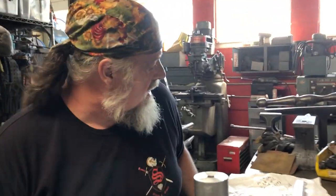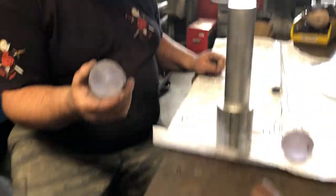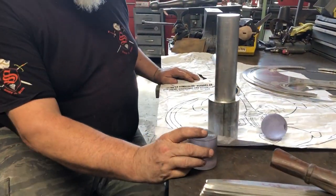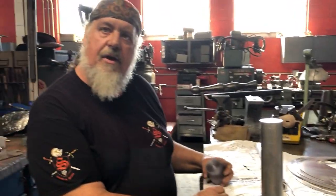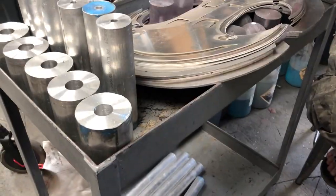So that cap — I've got it drilled with a number seven hole — I'll shape it up on the lathe, polish it all up, hit it with the green translucent paint, and thread it with a 3/8-16 all-thread that's going to run through everything to hold it all together. So that's kind of where we are with a pile of parts. It's a lot of axes. It's exciting. Thanks Tony.